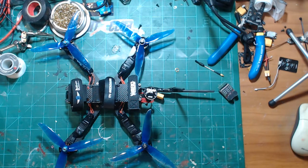Yeah, the Cricket does have MMCX, and it is tough. It's not coming out. It's not going to bust off like those stupid UFLs. I really don't have a dog in that fight, but I know I've ruined more UFLs than MMCXs, so that's what I'm going to try.